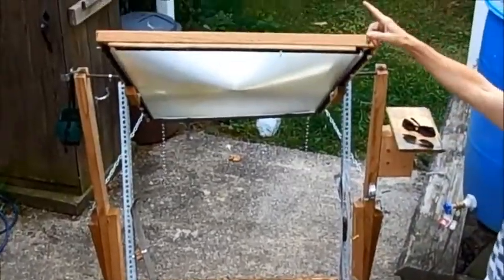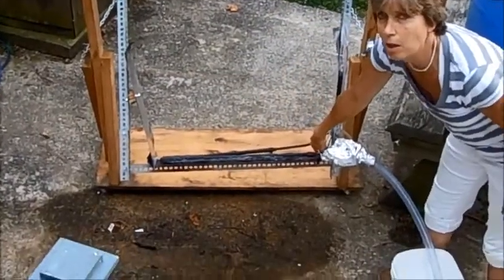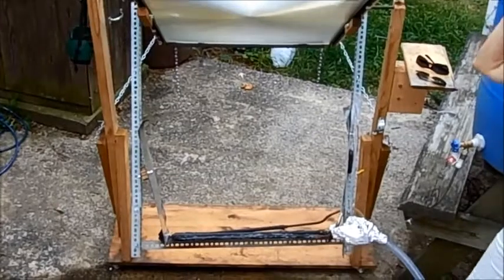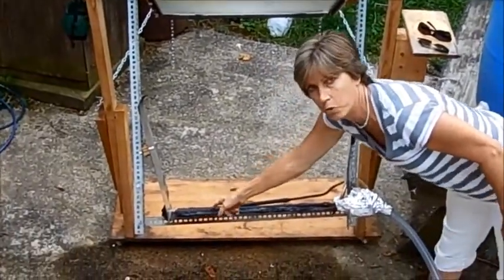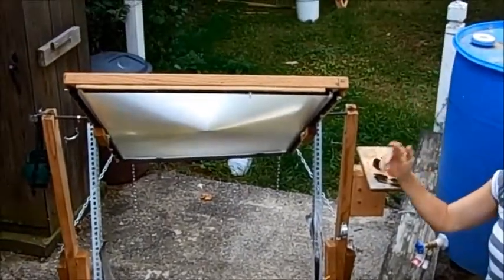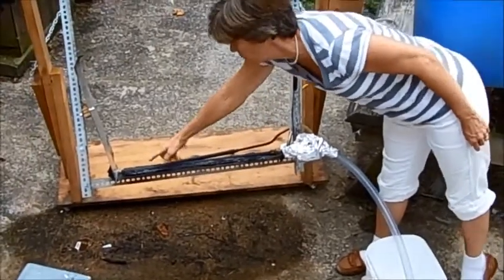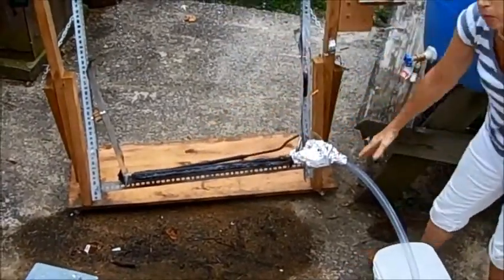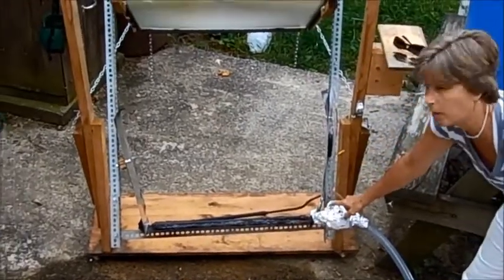In the morning, the sun is in the east. It hits the Fresnel lens and lands on this side of the coil. In the course of the day, the sun traverses the sky, and so the spot will move from this side to the other side, but it always will stay on the pipe. If the lens is oriented correctly at the right azimuth, the spot will be a linear swath that goes all the way across the top level of the pipe. It heats the water in the pipe, and the heat is conducted through the copper coil to the thermostat.